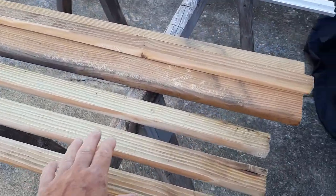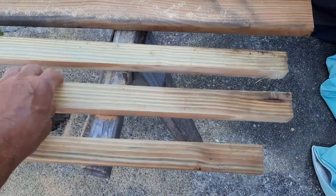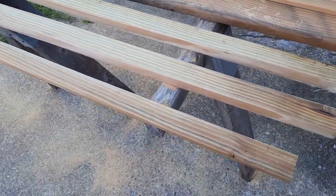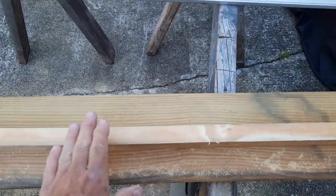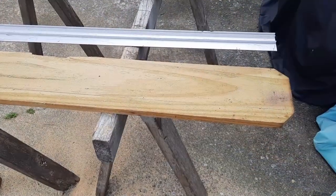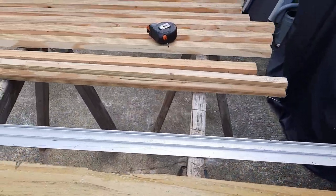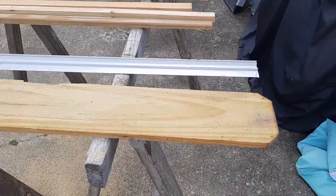I've got three pieces here. I took the end pieces because they're rounded off, and then when I cut the ones out of the middle they're square — I'll chamfer that a little bit. It's going to be about 12 by 3 feet — I think that's going to be plenty big enough, just so I can stand on it. This left-over piece will be my riser, and these boards will go on top of that. I also found part of a cedar fence board that I used to build my gate, so I'm going to use that as a riser since I didn't have quite enough of the inch material.